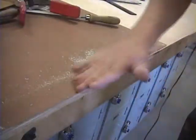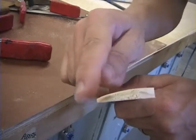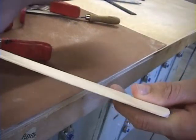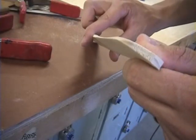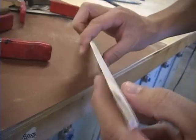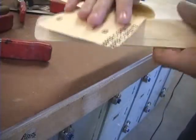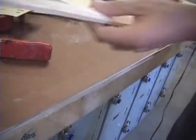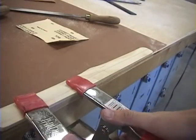After you're done with one side of the boomerang, flip it around and do the other side. If you look at this, it's angled down — not to a super sharp point, but a dull point that won't snap and break. It can be easier to sand while you're holding it, because then you can rotate it and get a much better sanding action. I'll go ahead and finish this off and then we'll get ready to glue it together.